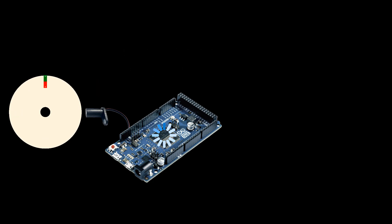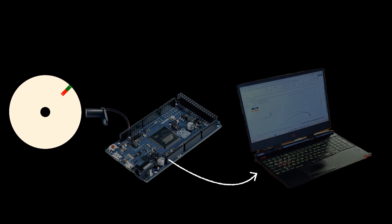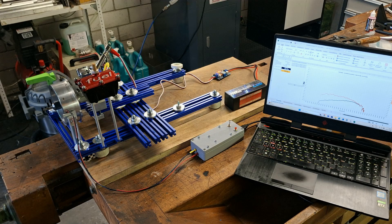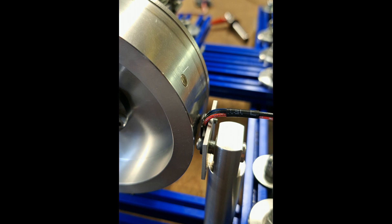The microcontroller sends these three calculated values to the laptop, which collects them in Excel and displays them graphically. Now let's look at how this works in practice. Here is the model engine with the flywheel. Here is the Hall effect sensor with cable. This box contains the microcontroller, and here is my laptop with open Excel. There isn't much inside the box — just a USB cable and the connections to the two switches and the Hall effect sensor. Here you can see the magnet in the flywheel. The Hall effect sensor itself is mounted separately and is approximately two millimeters away from the flywheel, so everything is contactless.